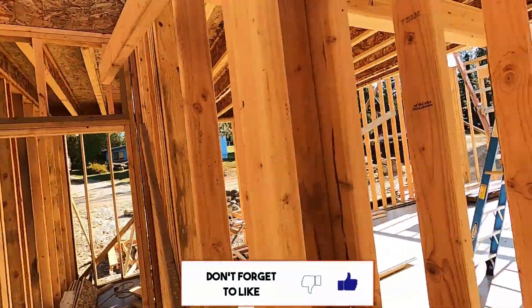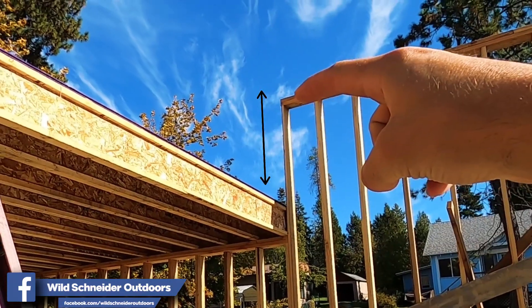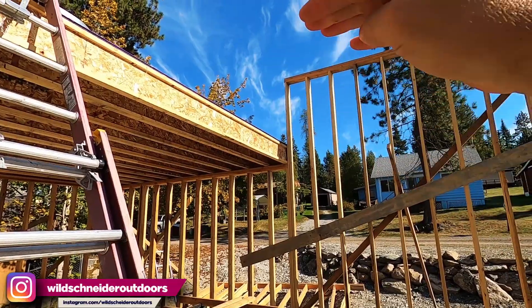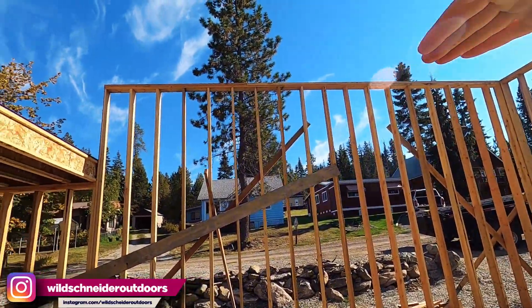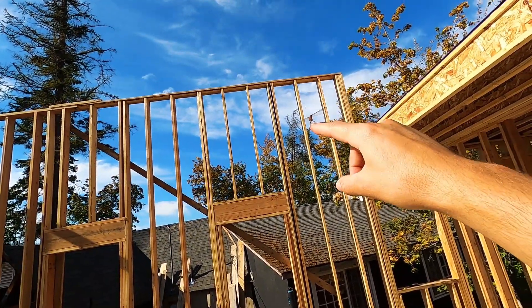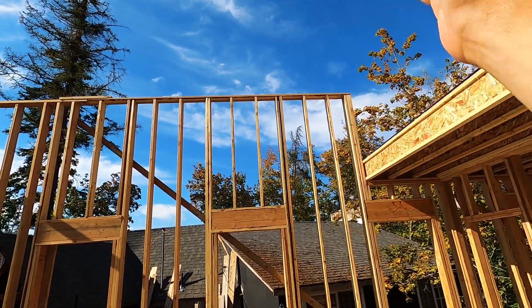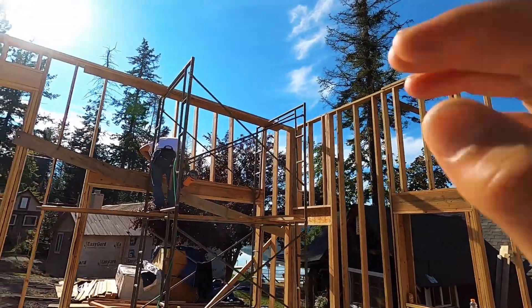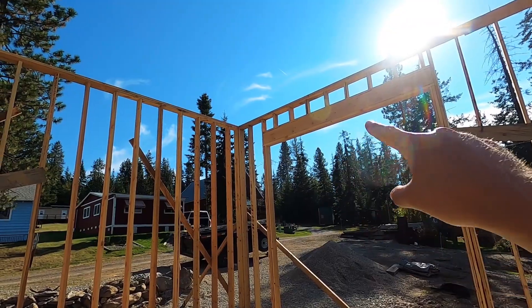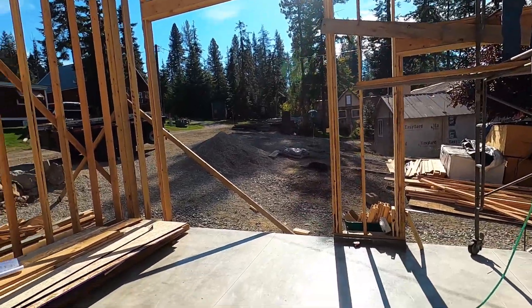It all needs to be the same level because from that point to there is the new wall we're going to have to build, and this all has to be 14 feet on this side — the front and this side over here — so that way when we put the trusses on they'll all sit at the same height. Up above the garage door we got that final header put in and then the cripples up top, and that's going to help carry that weight down to the header, out to the outside beams, and then straight down to the ground.